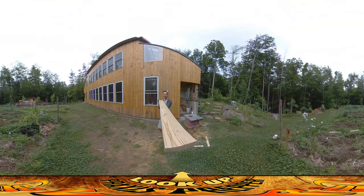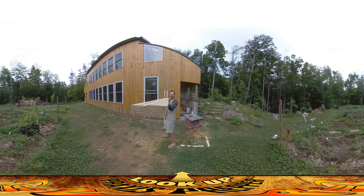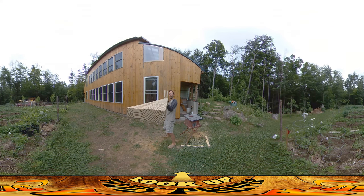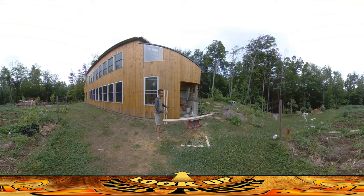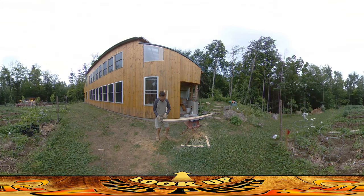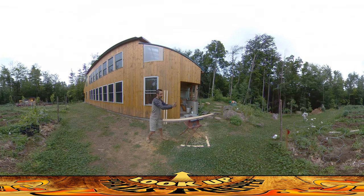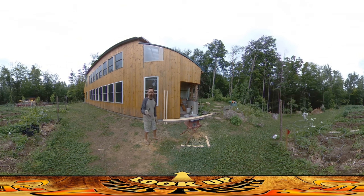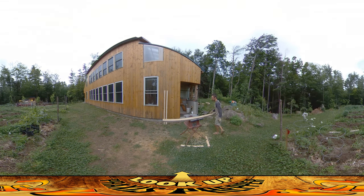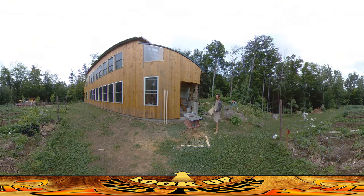Now, if you look at this piece, you'll see there's a little bit of a bow to it — it kind of sticks that way where there's kind of a bump on this side. That's the way you sight a board: you look right down it, and you can see how it's kind of bending. I put a board that I know is straight, sighted down along it, made sure it was straight, put it down and scribed the line — it's nearly a centimeter fatter on that end. So I'm going to take this, put it on the table saw, run it down, make it so I've got one clean straight side, and then I'll use that to cut some extra boards off of it. These video runs on this 360 camera oftentimes cut off before I finish, so I'm just going to run this through the saw, and if there's time afterwards I can show you, and if not, you can imagine a straight line. Here we go.